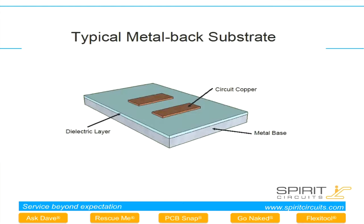Looking at the structure in more detail, the copper foil is basically the circuit. It comes in anything from one to ten ounce, and typically two ounce is the most common. An increase in copper weight does help with the efficiency of the thermal properties. However, as the copper weight increases, the costs also increase, so you have to balance that calculation.